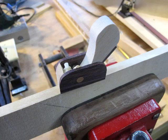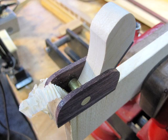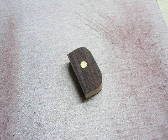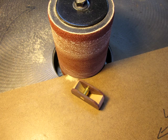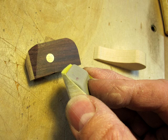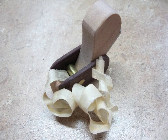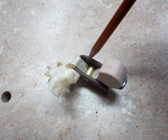In this particular case the mouth was still a little too tight — you can see the shaving couldn't escape. So I worked it again until I got a shaving that I liked. From there it's mostly a matter of cleanup: a little sandpaper to the sides, the drum sander to put a round portion on the front of the plane to help it jump over bridge patches or back strips. A little 220 grit wrapped around an eraser, and of course my initials 'SB' on the side. A few more test cuts and it's working pretty well.